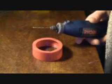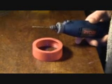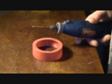Now it is time to mark the location on the core where the LEDs are going to be mounted. I recommend putting the two halves of the thermal detonator together to give you a better visual of where your LEDs are going to go. Here you can see I have found and marked my center point. Now drill out your center point. I recommend using a 1/8 inch drill bit. Now that you have your center hole drilled out, we can test fit one of your LEDs.